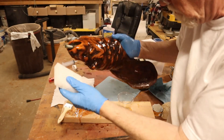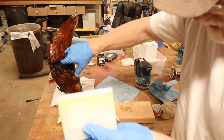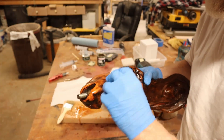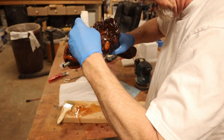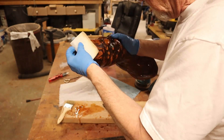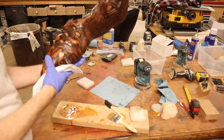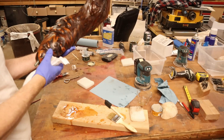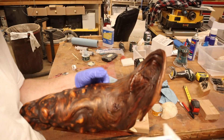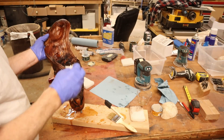I switched to a foam brush and used a white 3M pad to rub it in and pick off more bristles. I'm not recommending the inexpensive bristle brush for Rubio Monocoat. I got all the bristles off, let it sit for 15 to 20 minutes, then wiped off the excess as instructed — get a good thick coat on, rub it in, then take the excess off.